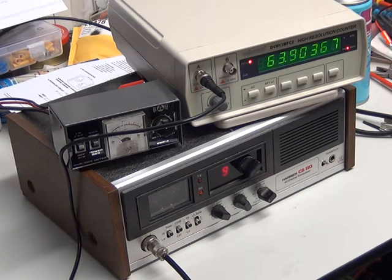Today's video is the next one in our series on servicing CB radio on a shoestring budget. One of the next things you need to be able to do with a CB radio is make sure it's on frequency. When you look at some of my repair videos, I usually show you how we adjust the frequency — sometimes there's one crystal as a master oscillator, sometimes three or four, and they have to be done in the right sequence. To do that you need a frequency counter.